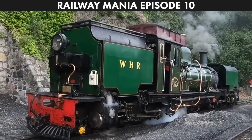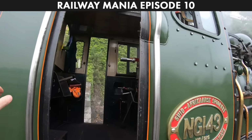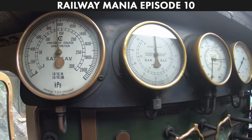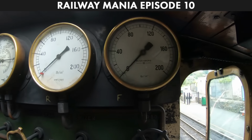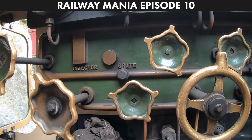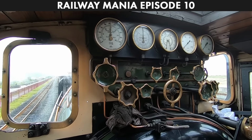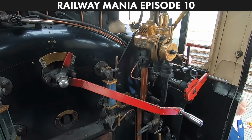Yeah. Something that we have come up with quite recently is we fitted a ball valve into the injector steam valve on the fireman side, because we found that they were wearing so quickly we were replacing them near enough every 2 or 3 days, or working on them every 2 or 3 days. Out of curiosity, one day I asked one of our firemen, I gave him a little paint marker, and I said, every time you turn the injector on, can you just mark the side of the cab to see how many times it came on? And I think he stopped counting at 52, and he hadn't even got halfway yet. So what we decided to do was use the old valve, the one that's on the manifold, as a shut-off more than anything. So he turns it on in the morning, and we've quite well hidden a ball valve. I don't think it affects the aesthetics that much underneath the foot plating in the cab. So it's much more reliable and a lot easier to work on. Yeah, definitely, to repair them.